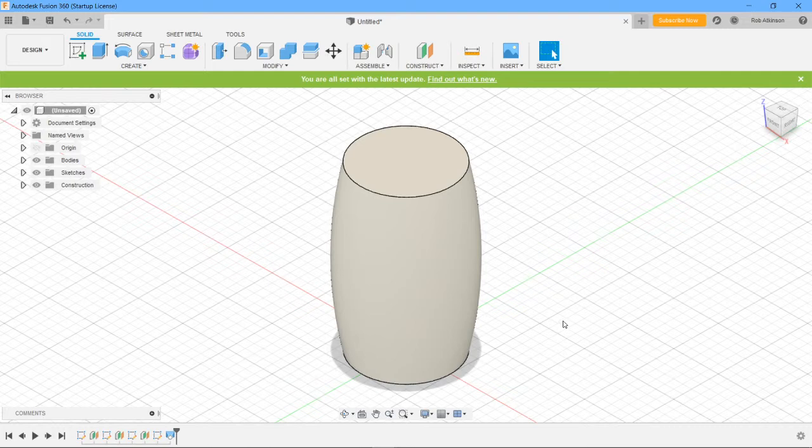So we have our roller wheel effectively, and it's 10 millimeters across here, 10 millimeters across there, 12 millimeters across the middle, and it's a total of 18.5 because 9.25 up to the middle, 9.25 up to there. Now I could have made it 20, but 18.5 seems to be about the right size given the existing one. Now, the middle of this barrel is going to be printed in TPU, which is a slightly rubbery or softer material, which is really funky for all sorts of things like phone covers and rubber bands. I printed rubber bands too. So TPU is much more elastic, whereas PLA is more rigid.